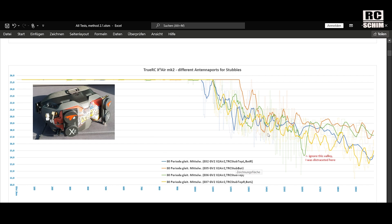Always the same antennas, same goggles, but different orientations. To make it short — between green and orange or dark orange/brown, there's not much difference. Both stubbies on the top or both stubbies on the bottom work best for me, period. And the diagonal — top-left, bottom-right — what many guys tell you — not really good, at least not at the far end. I was really happy to once and for all test this diagonal myth.